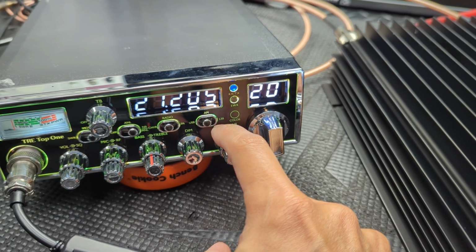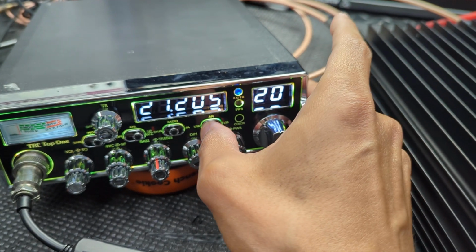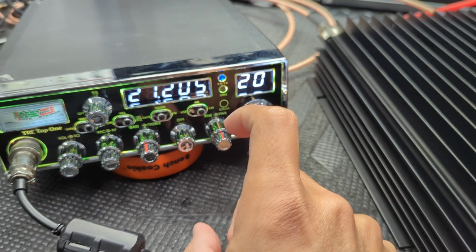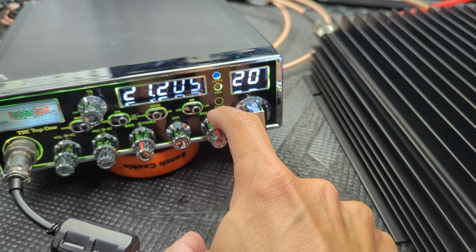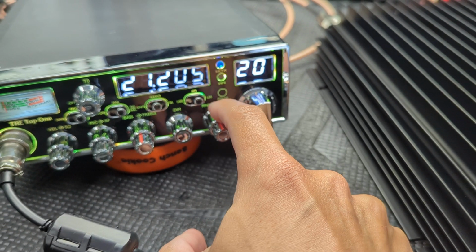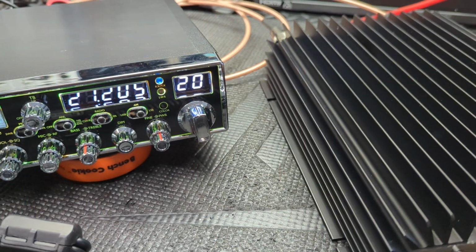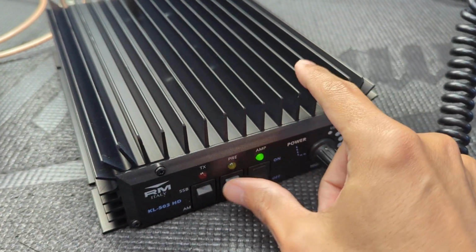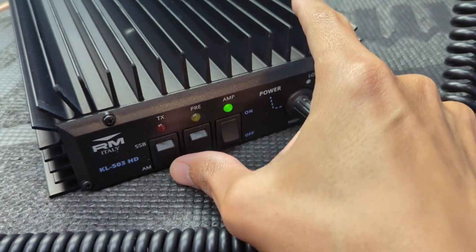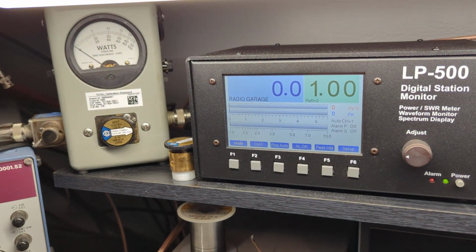All right? Okay, now the other thing, that's all for AM. Sideband, totally different deal. Sideband, you throw that over to here. It doesn't want to zoom in or focus. Now this guy can come this way because we don't have a carrier to worry about. Then this goes to, let's see, sideband. Still have that all the way up. And now I'll check it for power.